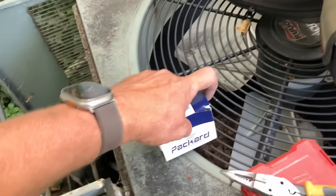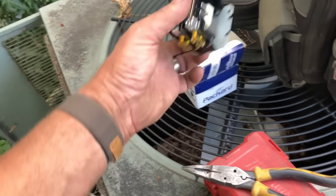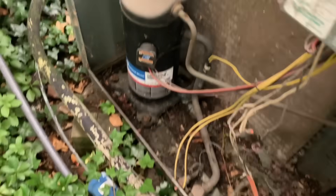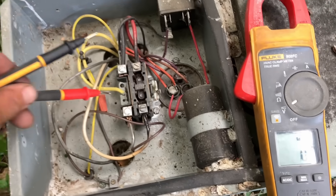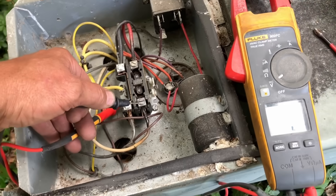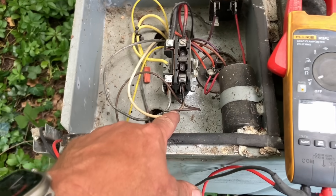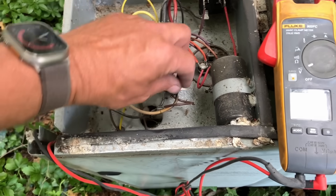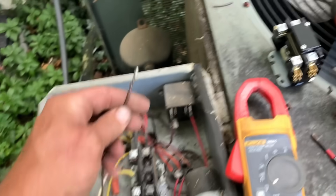Contactor flip — nailed it. Shout out to that YouTuber/Instagrammer who's an HVAC contractor in Palm Beach County. You could put in a two-pole contactor if you don't have a crankcase heater — we don't have one — but we're just going to duplicate what we have and put this in its place. Got my voltmeter out; let's check for voltage, make sure we are safe to work on this. Nothing there, nothing there either — perfect.